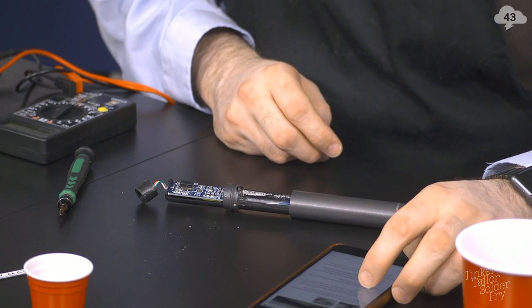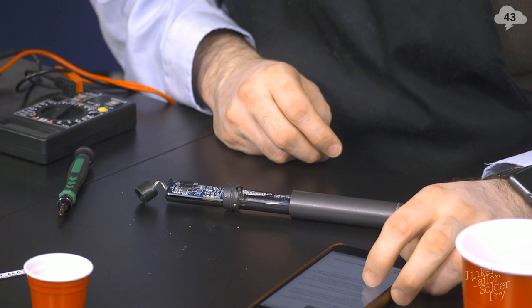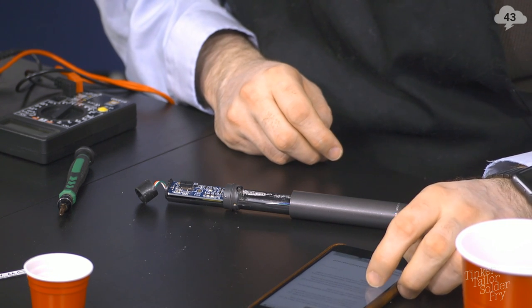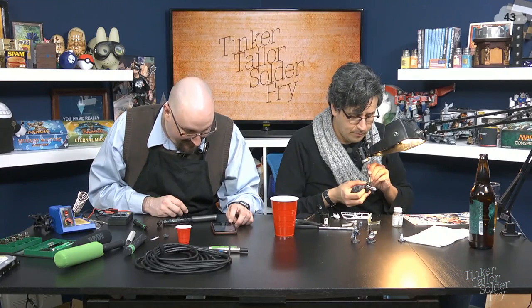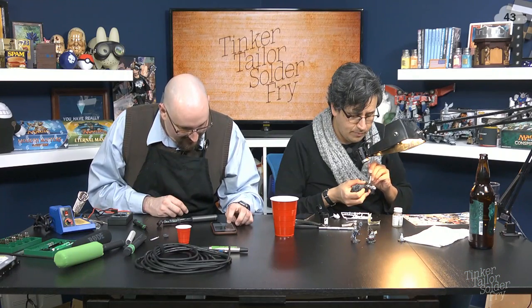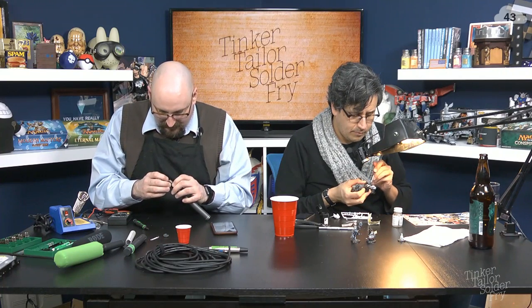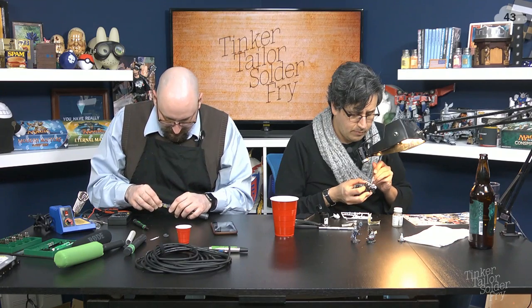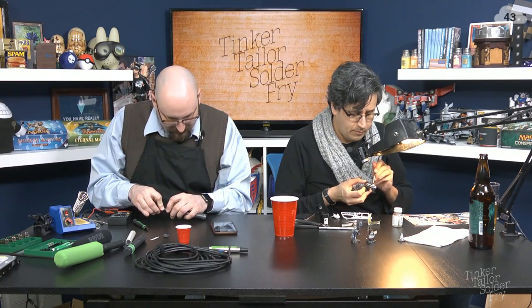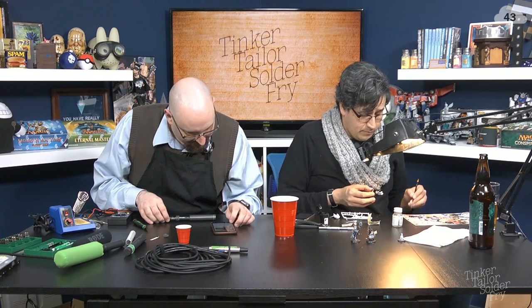In order to do this, you'll need to disconnect the capsule from the circuit board as well as the bottom cables leading to the terminal. Before you disconnect, take photos of the wiring on both ends of the port so you can resolder them correctly. Oh boy. Well, this is going to be harrowing. I actually need to desolder that. That does not make me happy.